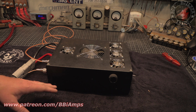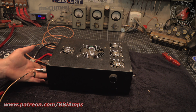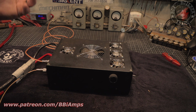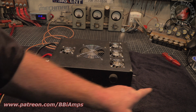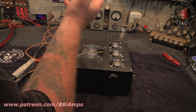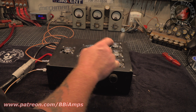You know, it's not really the right term. There's a lot of surface tension drag that takes place as the air moves across the fins, the heatsink fins. And then with the slotted ports on the back, we have even more drag that now the air's got to bounce around and try to find a way out. Well, you can blow air in here as much as you want, and until you increase the space in front of the heatsink, you're not going to see that much air pressure unless you go to something like a blower, which is designed to have a back pressure, a resistance to its airflow installed. 120 millimeter fans, not so much designed to have back pressure upon them.